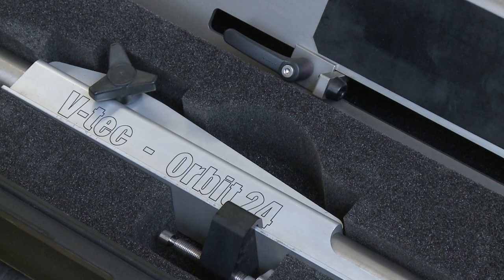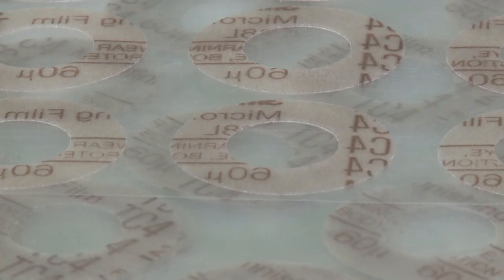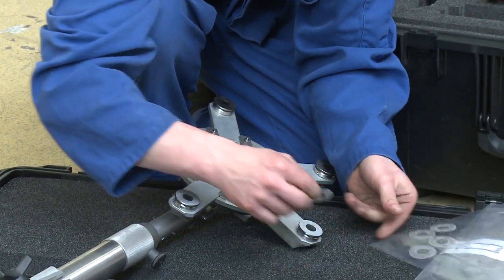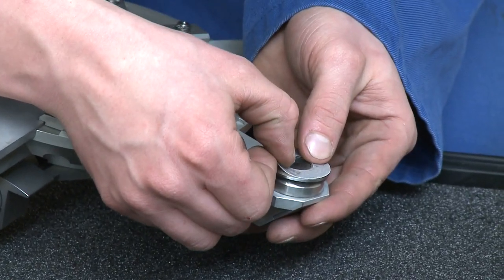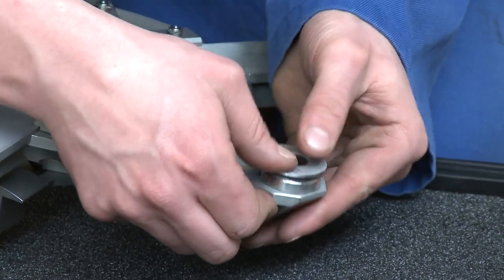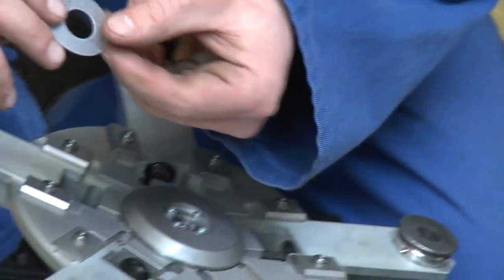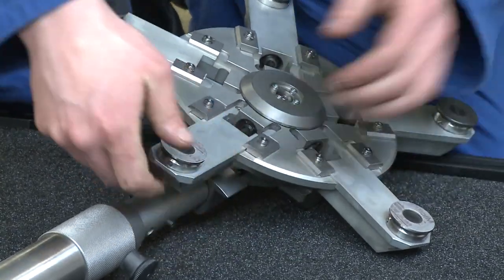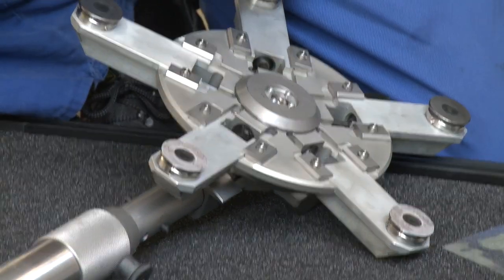The Orbit is delivered with an extended range and quantity of grinding and lapping foil rings. The self-adhesive polyester based aluminum oxide rings are standard delivered in the grains: rough for grinding with a high material removal rate, middle for pre-finishing or removing small scratches and damages, and fine for fine finishing and reaching the required seat tightness. The high quality rings are suitable for all common steel and stainless steel seat materials up to Stellite 4, 6 and 21.